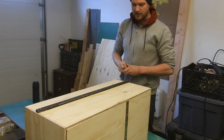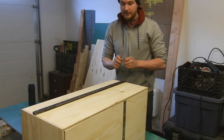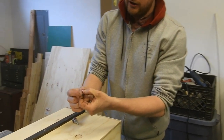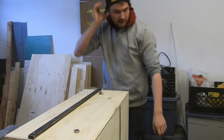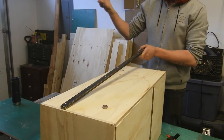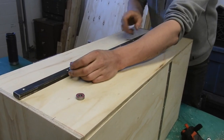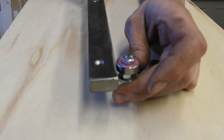Here's the end-all be-all discussion of our improvised budget drawer rail systems. We picked up these little guys — skateboard roller bearings. We got 20 of them on Amazon for 12 bucks and they'll pretty much roll forever in this application. We're going to mount up these rails inside our van, and then mount our wheels through our drawers. When they roll out it's going to look like this.